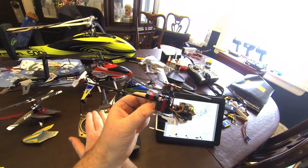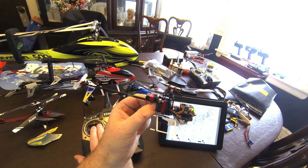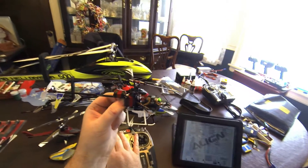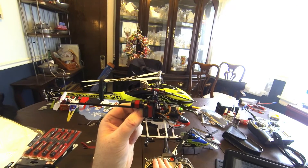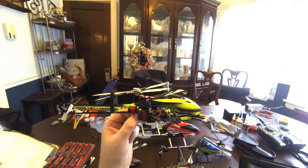The last one is motor direction. I go down — one beep, then up for normal motor direction. Now it's going to give me three long beeps, and I go down. It's going to go back to normal mode, and everything is now programmed.